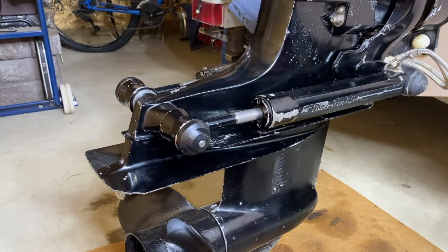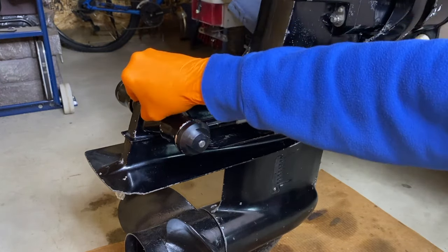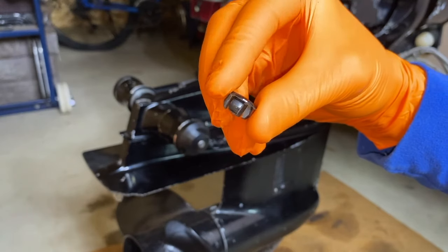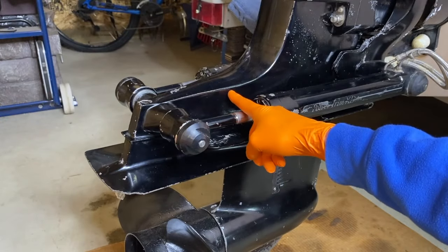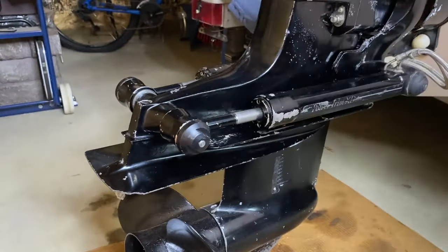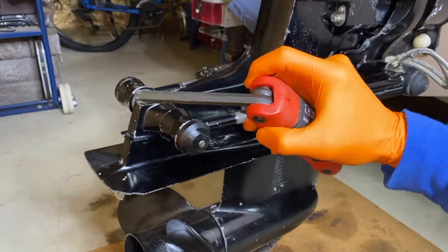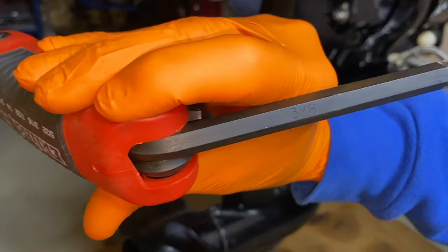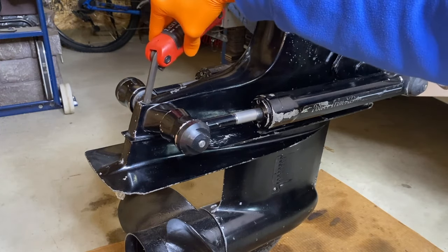DIYers, I had the camera positioned — we are looking at the starboard side of the outdrive. We are going to carefully remove this little plastic plug here, and it should come off pretty easily. There is a close-up view of that little plug. We bought a brand new one when we were doing the upper unit rebuild, because the old one was in really, really bad shape. Set this in a safe location. We now have access to insert a 3/8 hex key or Allen into that little slot. Here is the tool I am using — again, 3/8. It may take about 5 to 10 seconds to align your tool with the inner bolt, so just be patient.